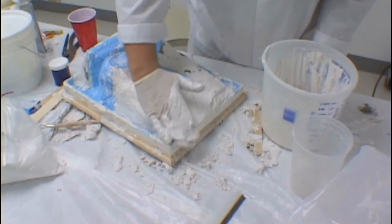The final plaster shell is made using the same technique as we did for making the plugs. We reinforce our castrite with fiber, applying it in a thickened state all over the mold and the existing plugs. After applying a nice thick layer of castrite, Michael uses plaster bandages around the shell to give it additional strength. You'll want this mold to last a long time and to be reusable over and over again, so be generous with the plaster bandages. Using nylon fibers as well as plaster bandages in the final shell molding process will keep your shell thinner and lighter.